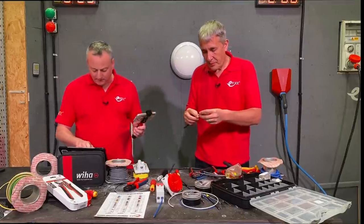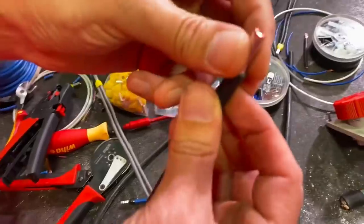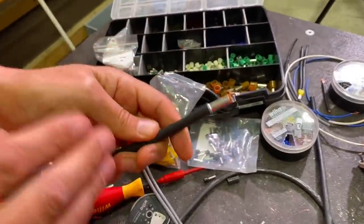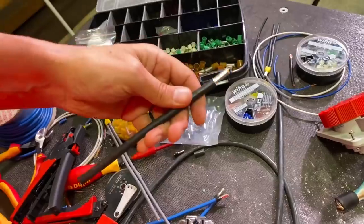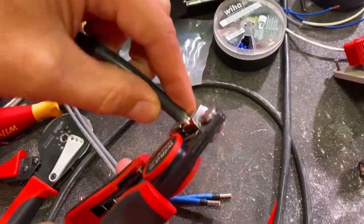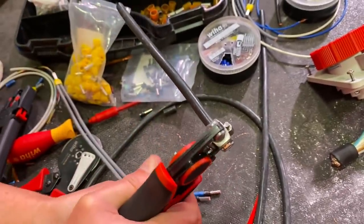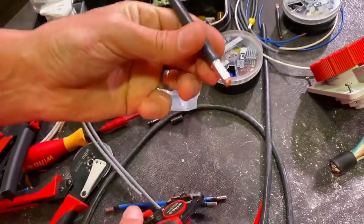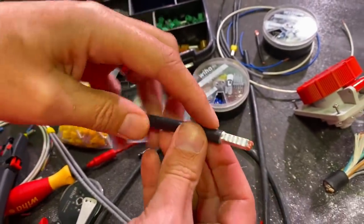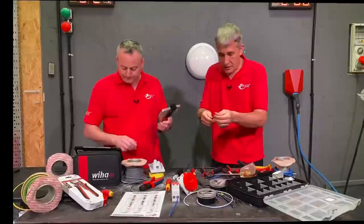This is a 16mm class 6 — it's got masses of very fine strands. Gary actually counts how many strands are in there in that video. We'll put this in — I've probably gone a little long on the copper, so I might just trim that. You can see there's no plastic end on this; it's an uninsulated ferrule. But that's a neat result — a neat tool.